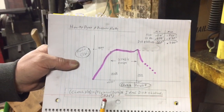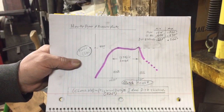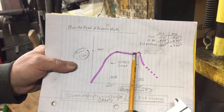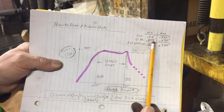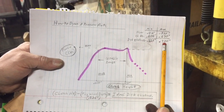If you've studied any stress and strain curves in engineering, you know this is where the steel is giving up — the spring is letting go. You're going beyond the elastic limit of the spring, so you really shouldn't be here. Ideally I set a minimum and max, back it up against the flywheel depth, and come up with the ideal disc thickness.